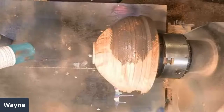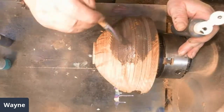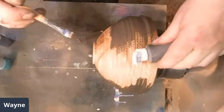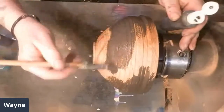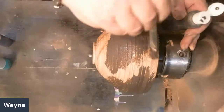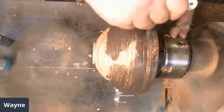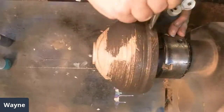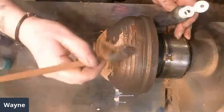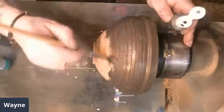That's the reactor there. You have got to be extremely careful when you're using the reactor. They recommend you wear gloves. And also, on my recommendation, don't get it anywhere near anything to do with your lathe or chuck. It will rust it in the blink of an eye. It's an irritant to your fingers. Unless you've got metal hands, in which case they're going to get rusty. So it's still recommended that you wear gloves even if you've got metal hands.